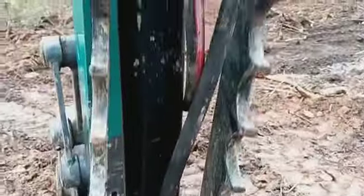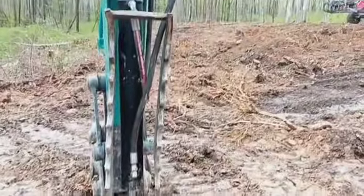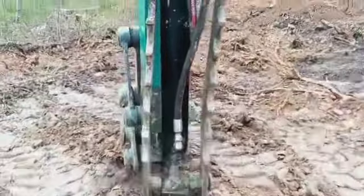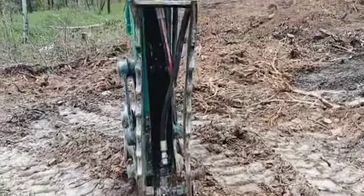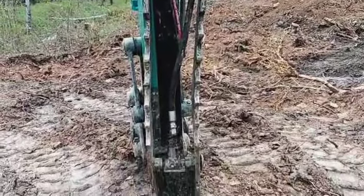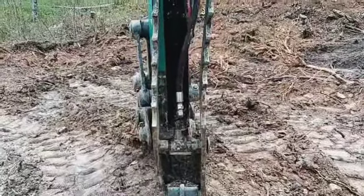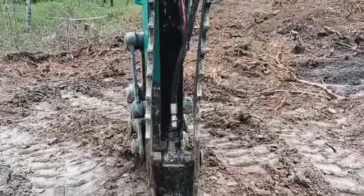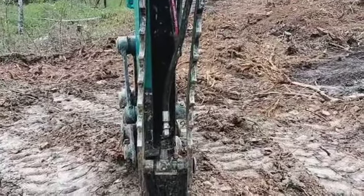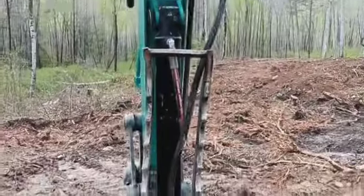But the overall design — if you look at it, it's already bent. You can see it's got a bend to it, and this is the way it sits on the excavator. So both of the hydraulic fittings are actually exposed. When you're digging and you're not using the thumb, the first thing that would contact the side of a trench or anything would be the fitting, instead of having the fitting to the top or the side out of the way. Very, very poor design.